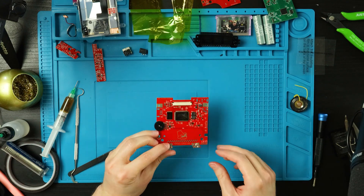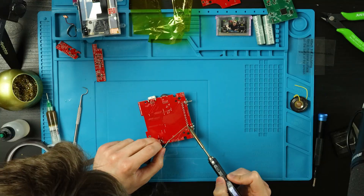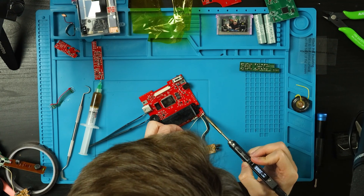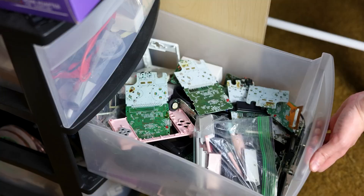This is an entirely brand new board with a lot of fresh aftermarket components, which I love so I don't have to transfer every single tiny component. While that does make life easier, this is still difficult to complete. The only things I had to do were solder down the CPU and crystal from a GBC, as well as the link port, power switch, cart slot, and transferring all of the pieces from the headphone jack's board of a DMG. Otherwise PCBWay did everything else for me. Honestly they could have done everything for the headphone jack board too, minus the headphone jack, but I wanted to see if I could just use the original board. It did not work for me, but I think that board was dead because I pulled it off of a DMG from my graveyard bin.